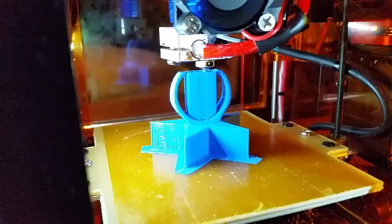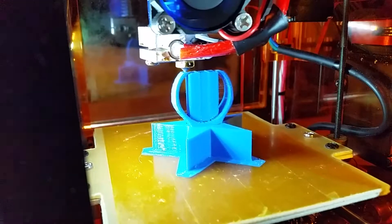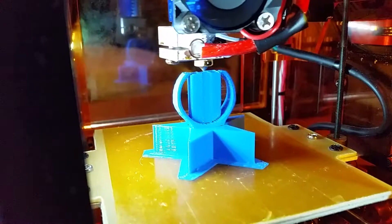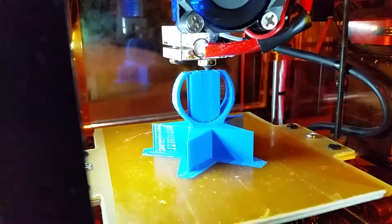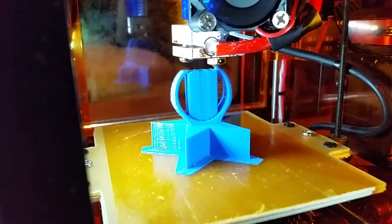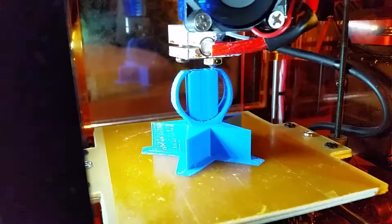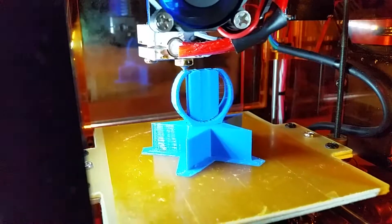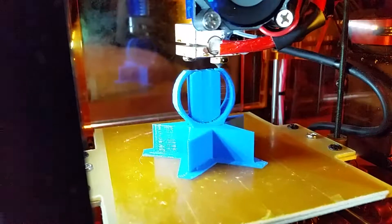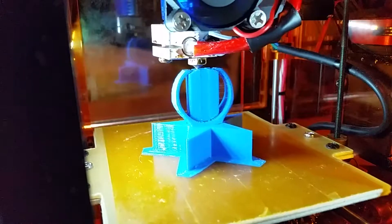Doing this as a voiceover, so I've already seen the outcome. I still have to increase the air gap — it was printed at 0.2. The one thing I have to say about Rigid Ink's PLA — the regular PLA gold stuff and this PLA+ — is that the layer bonding is insane. You really got to watch your supports; they need quite a good gap and some cool down to allow the support to be just a support, otherwise it can be a bit of a pain to break away.